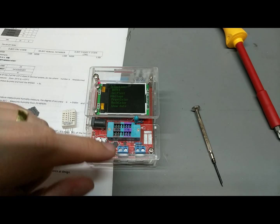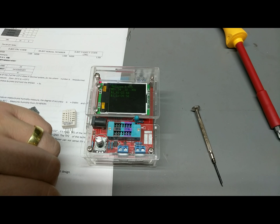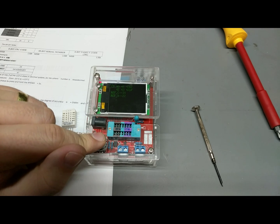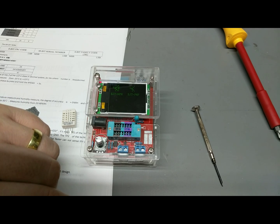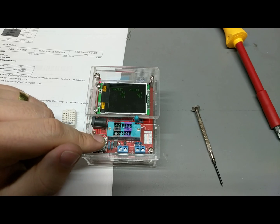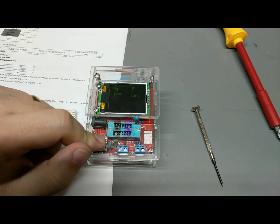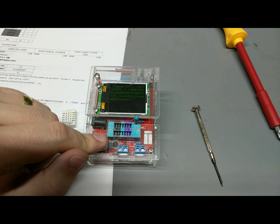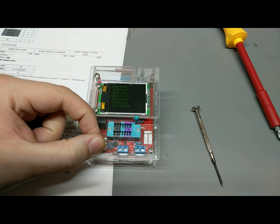So then it has a standard self-test menu. Then you can go explicitly into the voltage reading in the front. You can change the colors. Let's see, what's this show data? 1.12 with its calibration values and other calibration values. Looks like, oh, and it gives us some pictures. So BJT NPNs, PNPs, JFETs, which I don't have any of those. That'd be nice to test. IGBTs. Those are a little bit oddball. PMOS and NMOS. Oh, DMOS and EMOS. And all the other various symbols. And a printout of all the selected characters and stuff. Show data, switch off. Okay, now this is wrapping back around.